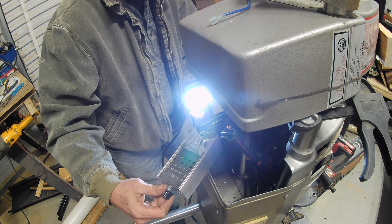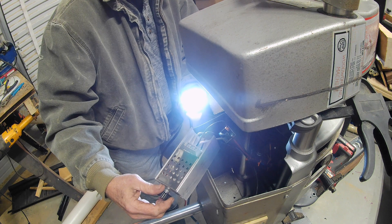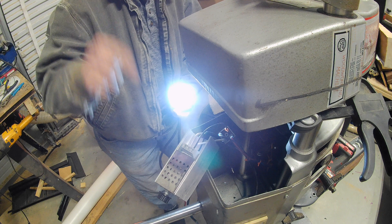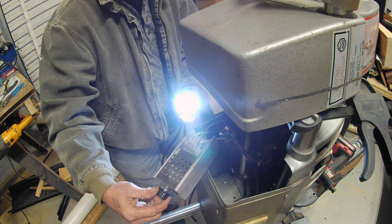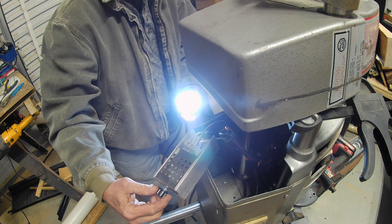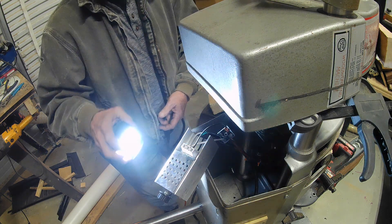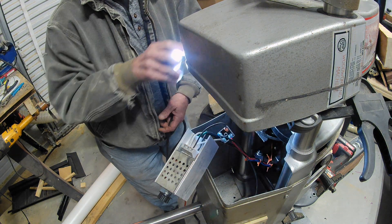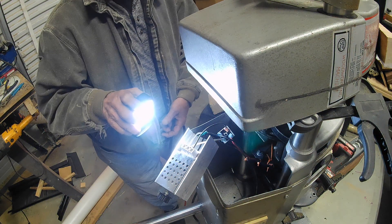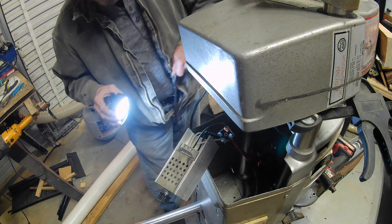My first smoke test comes out okay — I don't see any smoke. That's a good smoke test. But we've got to change this potentiometer — I'm having to turn it probably three-fourths of the way around before it does anything. I think I'm going to run another wire off of it to put the switch up in a better place instead of it sticking out of this box. We'll go in the shop where it's a little warmer and get that done. I liked the way it sounded — it was fast, it was zipping. We just need to get it more variable, and it needs a different potentiometer to make that happen.